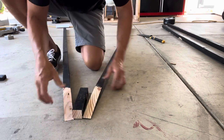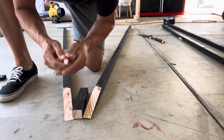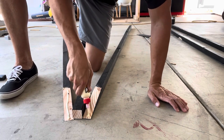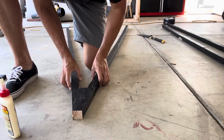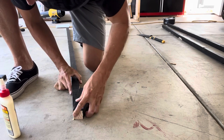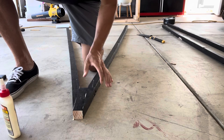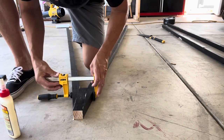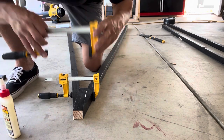Here's that 7 and 1/4-inch piece, and here are two of our legs that we just cut. If we put these together, we're going to set some glue on them and clamp it all together. This is going to be our first two legs, and then the other two legs are going to attach on the other side. So I'm going to run a bead of glue on each end, put these together, take one of our small clamps, and snug it all together. I'll go ahead and let this sit overnight.